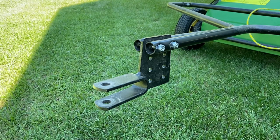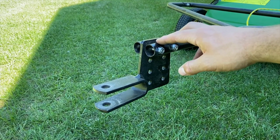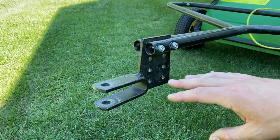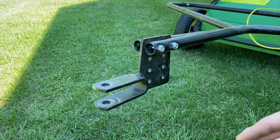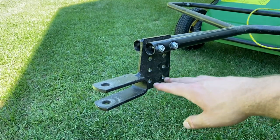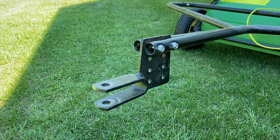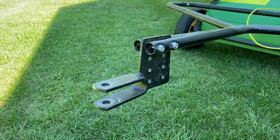If the setting is too low — like on the current setting — it's probably not correct because the 580 sits higher where the hitch is. So with this pushed up and raised all the way up, it's going to push the hopper into the ground and drag it. I probably need to remeasure it and bring this up so it pulls the back up. But looking at the blueprint a viewer shared showing the difference with the 44-inch, I'd probably recommend you go with this 42-inch for ease of use because that other hitch setup could definitely be a deal breaker.